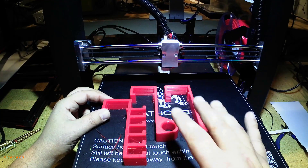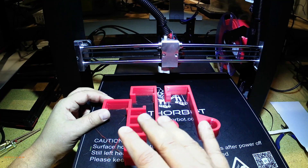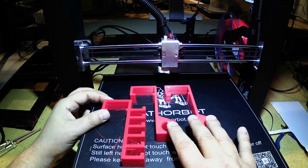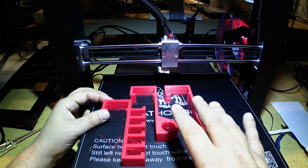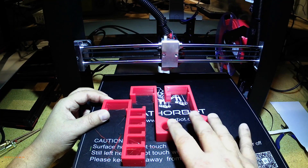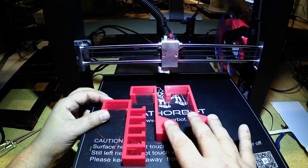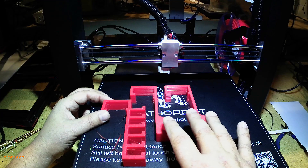I've run the same settings with Cura, and you can see the stringing I get. I don't really know what it is with Cura — I've talked to a couple of other folks on the internet and they're experiencing the same thing. The KISS slicer single-extruder version is free to download; the pro version only adds extra extruders. On KISS slicer, look under destringing for the retraction settings. It also has settings for moving inside walls and wall order, which are helping.